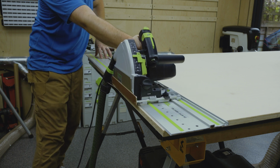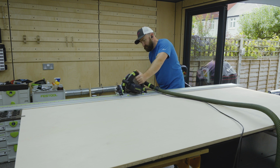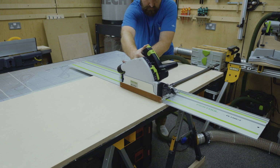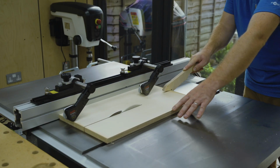As with all ply sheets, you will need to remove the rough factory edges and square one corner to serve as a reference for initial sheet breakdown. In a small shop like mine, sectioning the ply first with the track saw works well. With sectioning done, you can take your pieces to the table saw and get your panels to final dimensions.